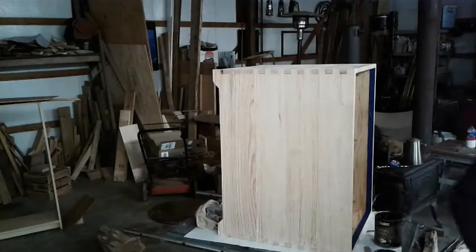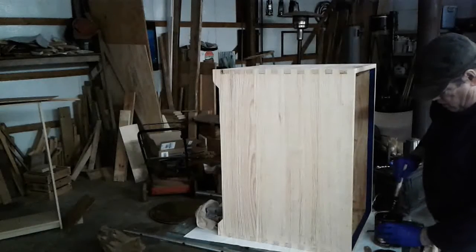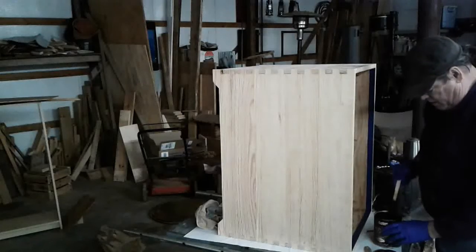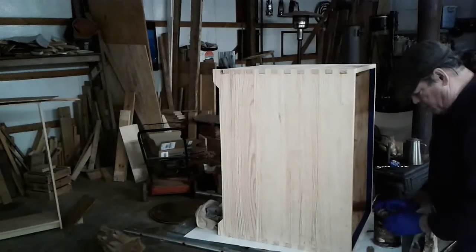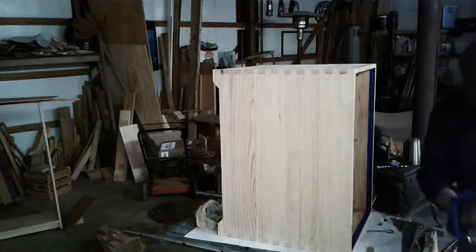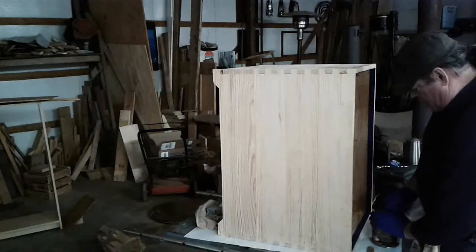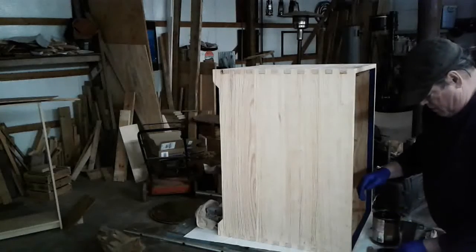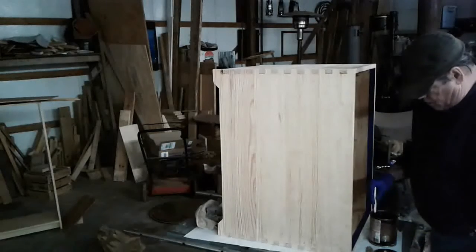Whoa, this is full. Oh yeah, it's all settled on the bottom. Actually, I think I'm going to shake this up. Stain is okay to shake. You don't want to shake up finish, like the final coat on like clear coating, because that will make bubbles in it. But here, yeah, that's much better. Okay, just have to stir every once in a while.